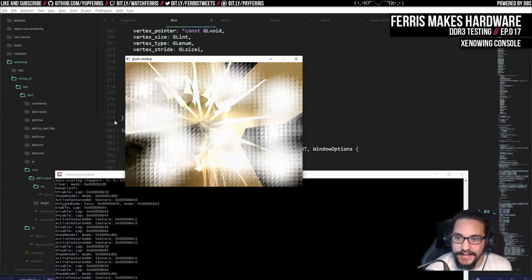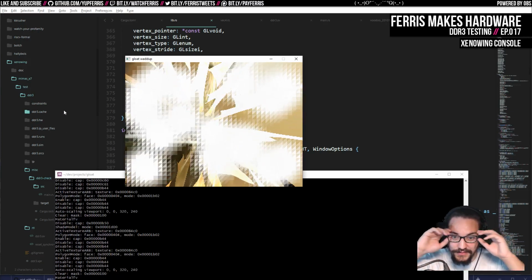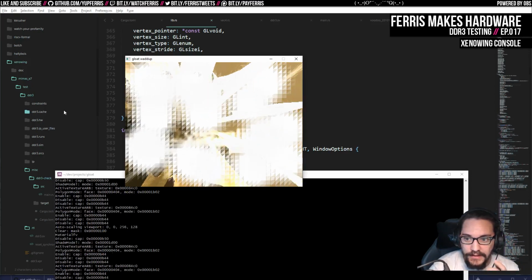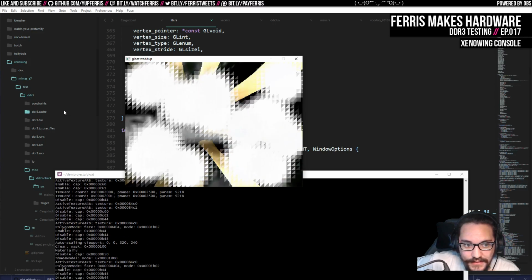And even if I only render part of the screen in order to make testing faster, that's still viable to me. So that's another thing that I have to do with the software renderer: I have to get everything to fixed point, and then I have to actually make it a tiled renderer. So I'll do some kind of basic form of binning and triangle preparation and stuff like that.